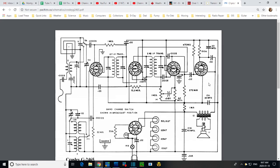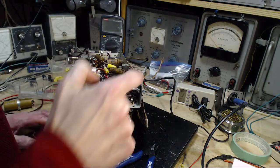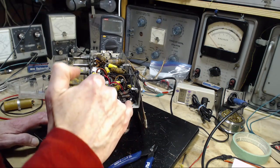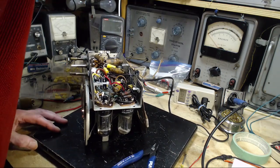Let me look back. Just bear with me a sec. I'm looking back on the radio again. Maybe I'm not seeing the leads properly. The radio's still on too. Jim, don't forget that. So yeah, it's on pin 3 of the output tube, but then it goes over to pin number... Oh boy. Pin number... It's this capacitor. So, output, rectifier. So hard to spot. There.